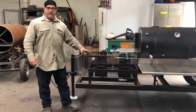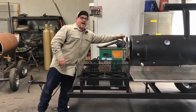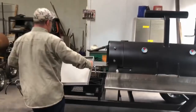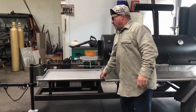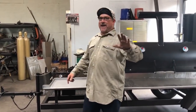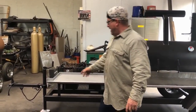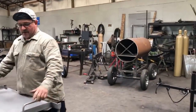This also has dual burners right up here. Has a shelf right here that folds down and locks. It has a flag and umbrella holder right here. This right here has a griddle — he upgraded with a griddle on it. It's a 3/8" thick griddle that'll go right here on these burners. We have a really nice grease trough on this griddle and a really nice grease drain that we made. I've modified many Blackstones — the griddles on those aren't deep enough on the trough and the drain's not big enough. He hangs a little soup can right there to catch his grease. It's heavy because we ain't building any junk.